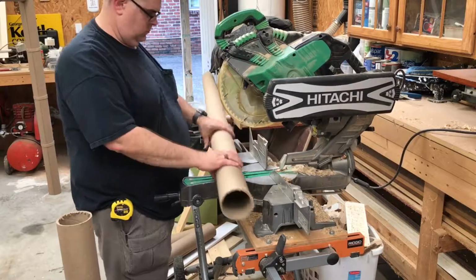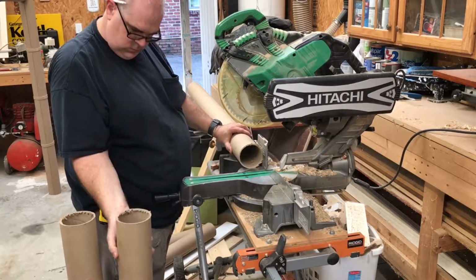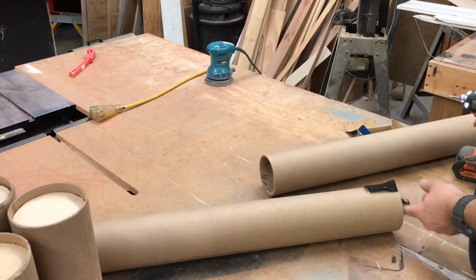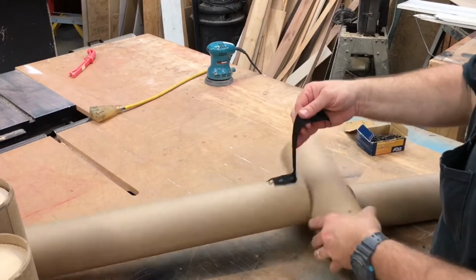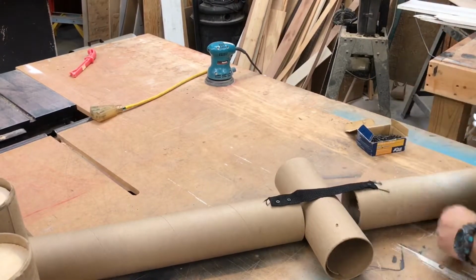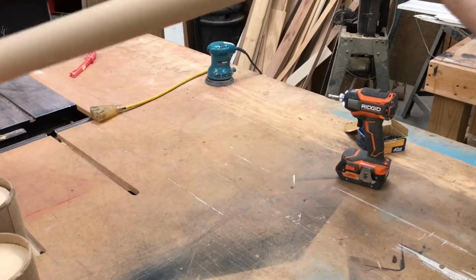Now we need to make some roof rafters. I'm cutting them all to rough length, and then we'll miter the ends and cut them to final length once we get them up there and space them right. I decided to attach opposing roof rafters together with a piece of nylon strap. This way I don't have to make any complicated joints where they meet the ridge beam, making for easy disassembly and transport to the church.